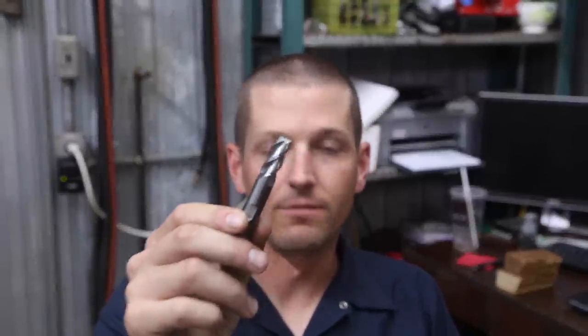For years I used this tool here and I loved it. We've done a video on it, it's been very reliable, I love it, but it's expensive — it's a $50 or so solid carbide three-flute roughing end mill. It was my go-to tool. One of its shortcomings is that even though it's a roughing corncob end mill supposed to break up the chips better, you can pack the chips in there and get chip weld, which will instantly ruin the cutter and the part.